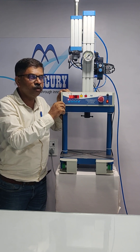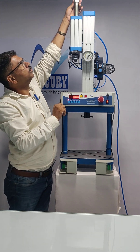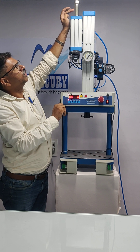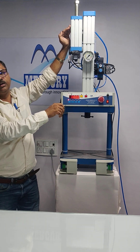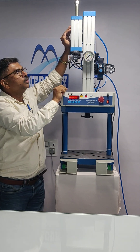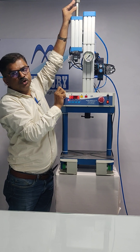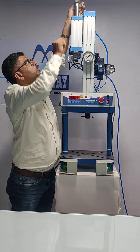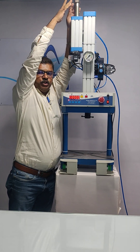You also need to check if the nut of the reservoir has come down midway. If it has come midway, it will restrict the travel of the reservoir and affect the power stroke of the machine. This nut should always be in its topmost position and locked with the lock nut provided on the reservoir threaded shaft.